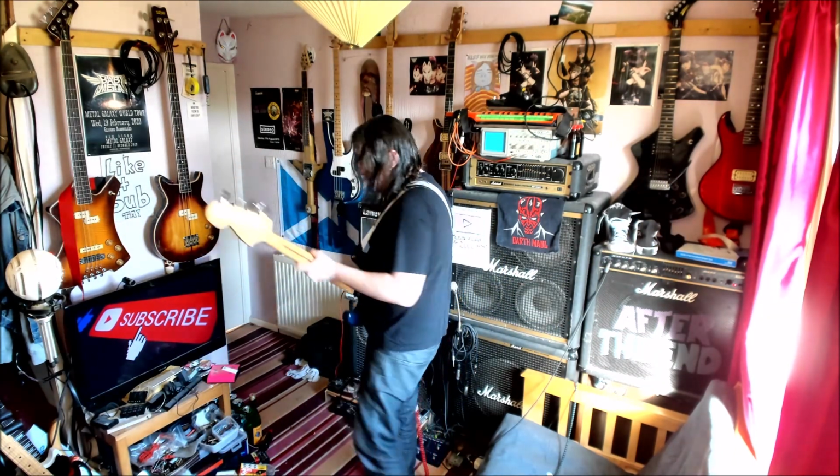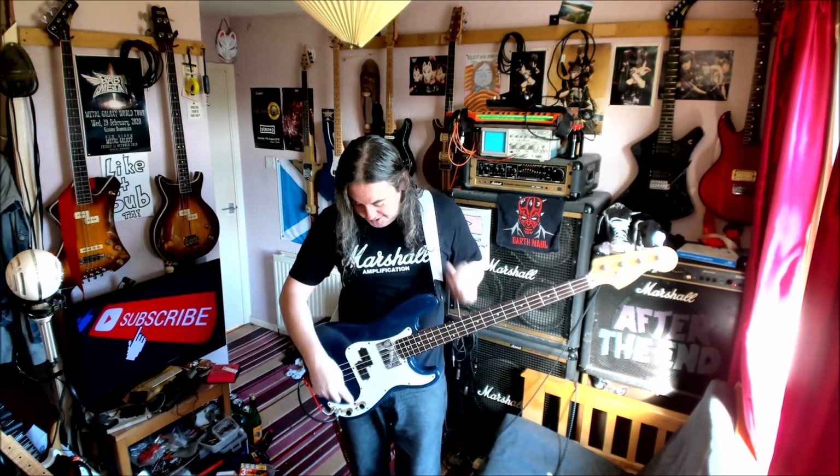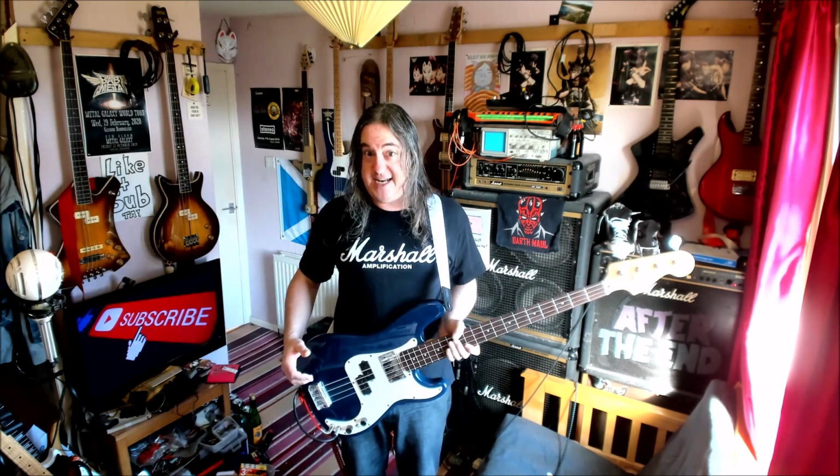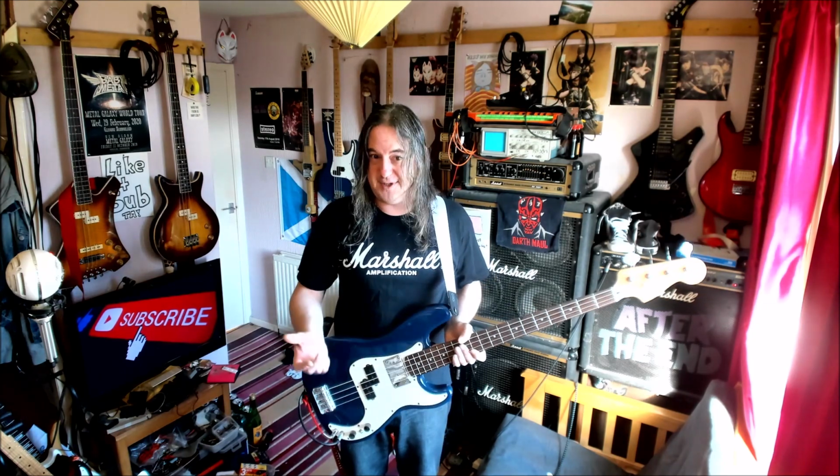Also, my favourite bit in this is it's got a special switch in it, which as far as I know no one's ever done before. Maybe they have. If you're going to try and do this, you do need at least a 9-pole, a 3P 3T switch, because of the switching in it. This switch has actually got 12 poles because I had one.